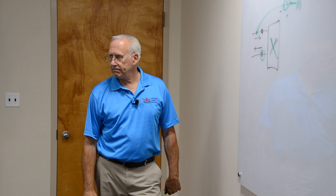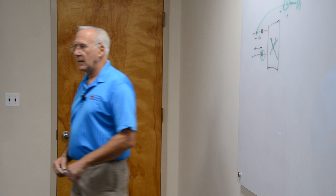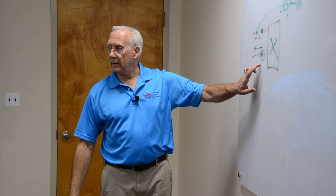The fix in the code says you can fix an ungrounded receptacle with a ground fault interrupter because it will still work. The fix to an ungrounded receptacle, if you want it to be protected, is to install a GFI. It will work. I just showed it to you. And that's why. You got this? You remember this? That's what we did here, right? You must hook them up correctly.